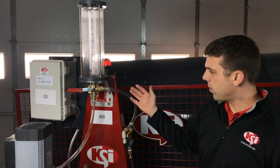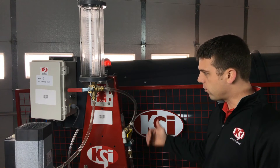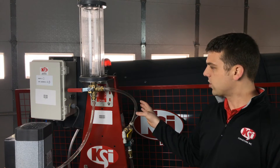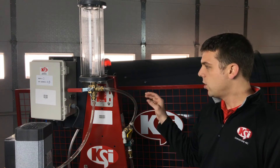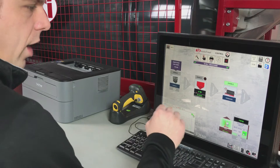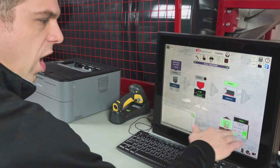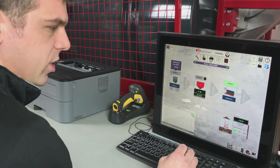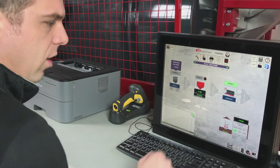As you can see, we're running this pump and liquid is just recirculating through the system. We're going to watch this and make sure that all of the air is out of the line. As soon as we're satisfied that that is the case, we can go back to our touchscreen. To turn a pump off you can push the off button, but ideally we put the pump back in auto. When we go to the calibration procedure, we do need this pump set up in auto.